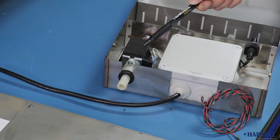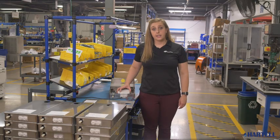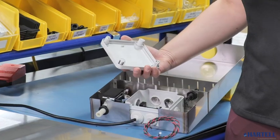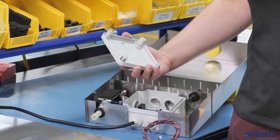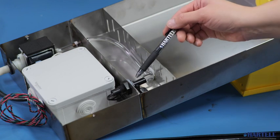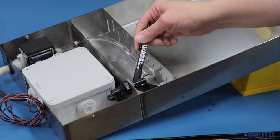All the electrical connections and the control board are contained in the NEMA 4X IP55 enclosure, with turn-lock securing screws to prevent water ingress on the electrical components. We use a single water level sensor mounted behind the debris filter to prevent loose debris from affecting the mechanism and its performance.